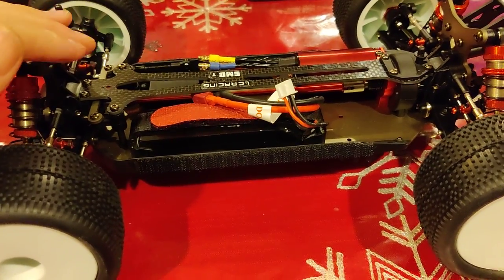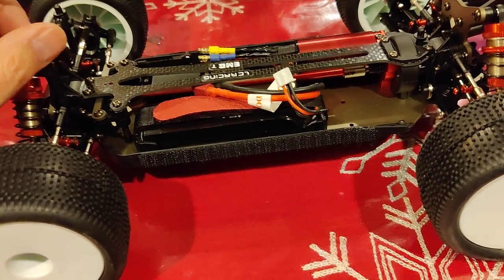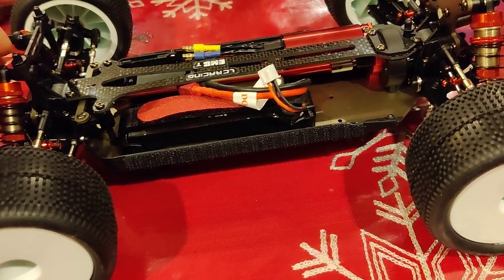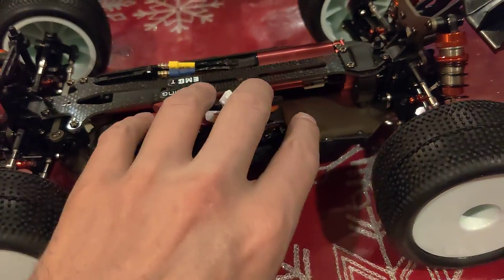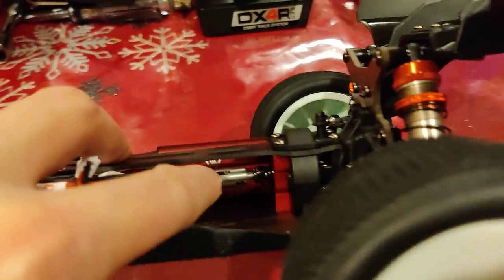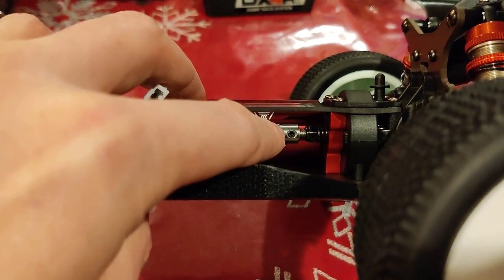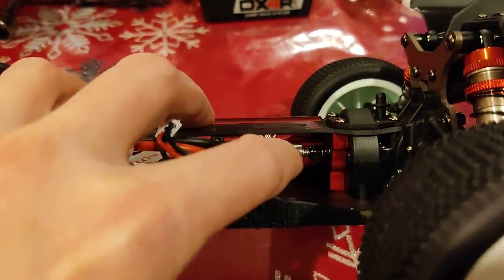All metal-to-metal connections on here use Threadlock. Anything metal to plastic, or plastic to plastic, obviously, no. Your set screws for these guys, let me see if I can spin that around there and get that to come around. Set screws, make sure you Threadlock all those.